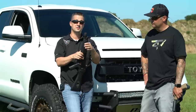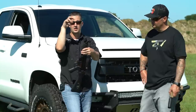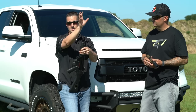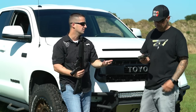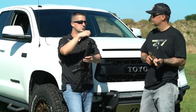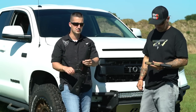What happens is when you go to shoot it on your pistol again and try to slide your piston in, your piston gets caught up on all the carbon deposits in there. This negates that and shoves all that in the can, which is serviceable. Not that the booster housing is not serviceable, but you have to sit there with a 50 cal casing or a flathead screwdriver and snap all that carbon off. So I just wanted to mention that.